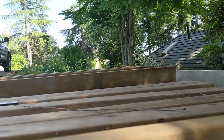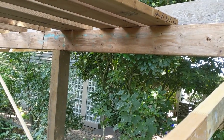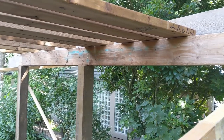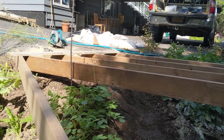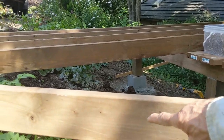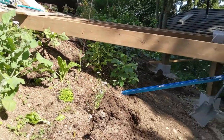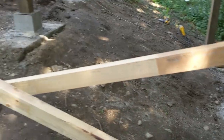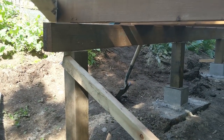So I'm going with my joist in here, start to build the floor - strong foundation. So what we have here: I have three posts on each side, that makes it six posts. And now we just use a two by six for the joists, all treated. And this one here we're gonna have a hump just going to the driveway, or once you come you just walk straight through it - gonna be nice. I might have to put another support in here. You see the span is a bit long, I'm just gonna put another post in there. You guys can see the brace in there - this is to keep everything level.